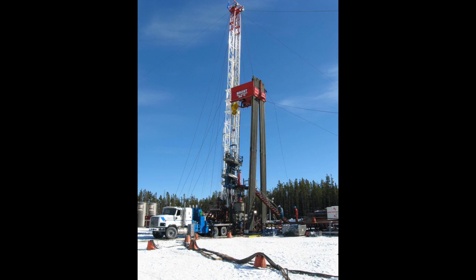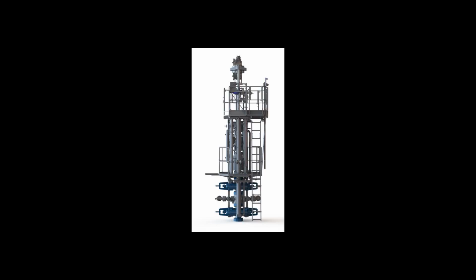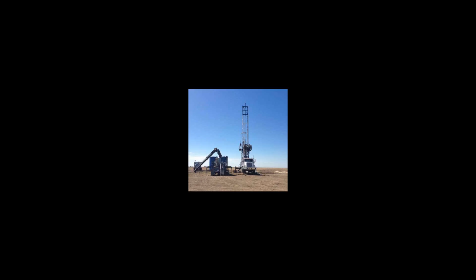Once a sufficient amount of pipe has been run into the hole, the weight becomes sufficient to overpower the wellbore pressure and the pipe naturally wants to fall in the hole. This is heavy pipe. At this point, the snubbing mechanism is changed over to the one which provides upward force to hold the pipe and lower it controllably into the well.